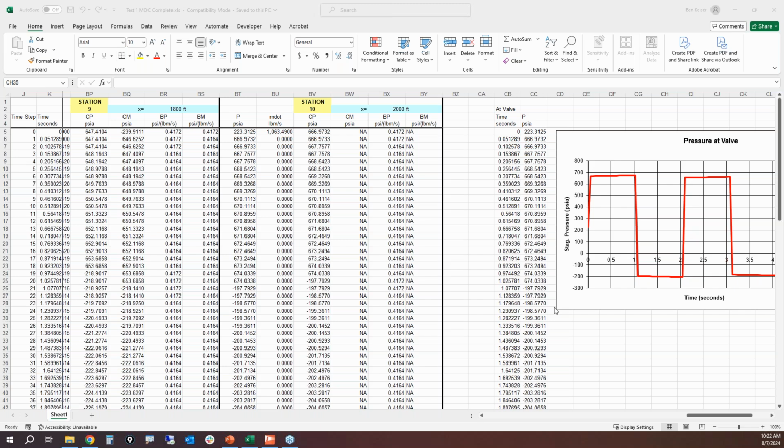Now we can use the Joukowsky equation to see if the instantaneous pressure equation matches. Now, something that I want to point out here is when the pressure stays at a high point for a little while, the reason why the pressure stays up at this point is because the high pressure wave that's being created is going to communicate itself upstream to the reservoir. So that's where the pipe has a high pressure. When the wave communicates itself back, we're then going to have a negative wave reflection. Now, that doesn't necessarily mean negative by value. It means basically that we're having a negative reflection. So, here is our positive wave, and then here's the negative wave. So I'm not meaning exactly negative pressure. It's just the negative wave reflection, okay?